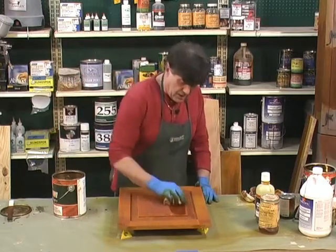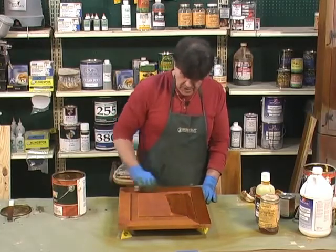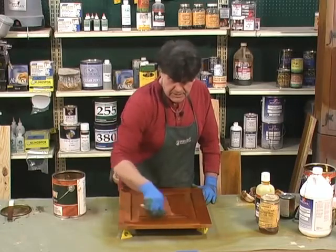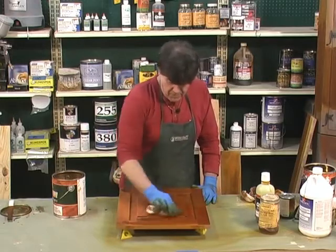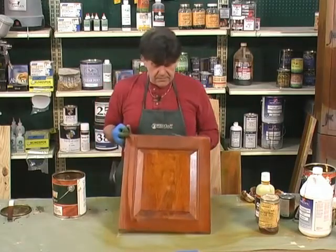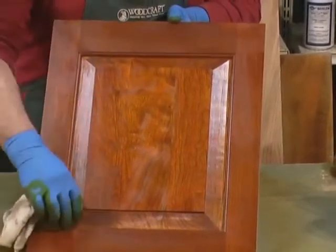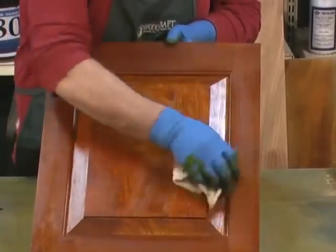But here's what I get when I color this. You know, one of the hardest colors in the world to emulate is natural aged cherry. Now, I doubt many of you would have considered using a yellow base to create that. And I'm not going to belabor the point, but I'm going to show it to you. And you can see where I didn't wipe. Here's the point, is that by creating a nice background and an equal background, we can get beautiful colors.